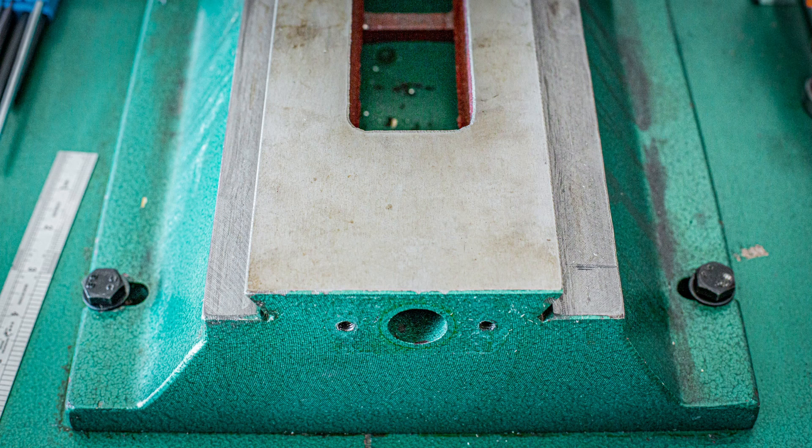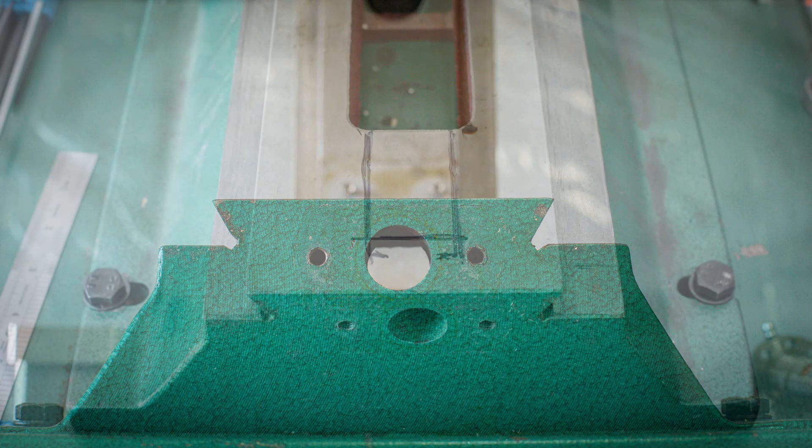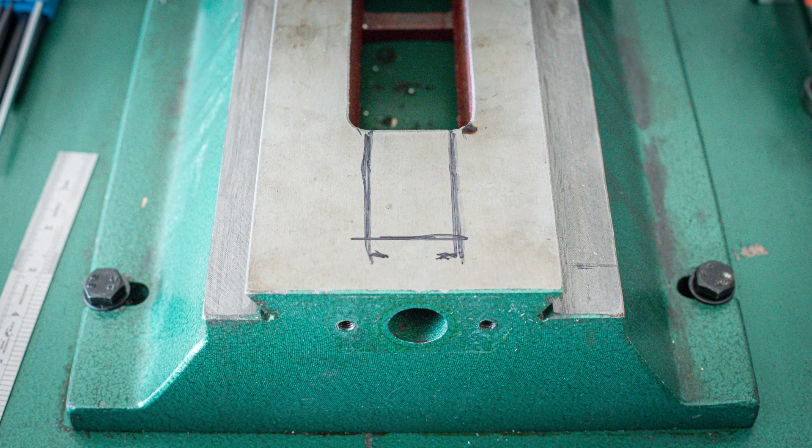The maker of the kit, Arizona CNC Kits, said that the Y-axis ball screw goes in from the top and I needed to open up the hole in the front to one and a quarter inches. He also said that I could open up the slot on the top to gain a little more cross travel. As we go along you'll see that I actually took more material out of the top slot than I needed to. I laid the double ball nut on the top of the casting and traced around it to get a rough idea of where I needed to cut.